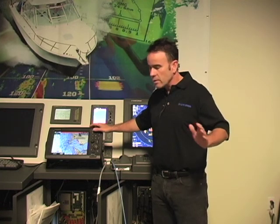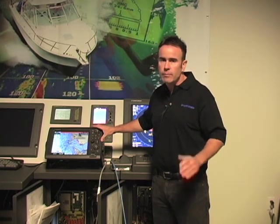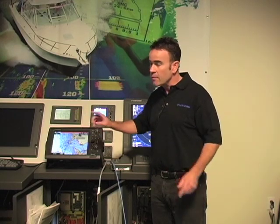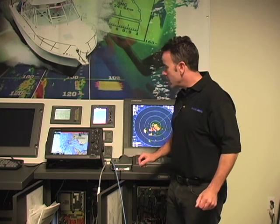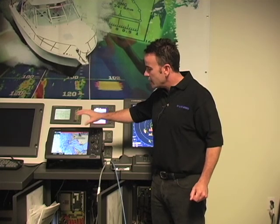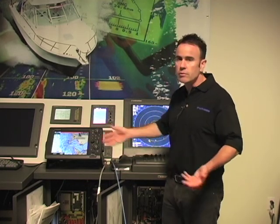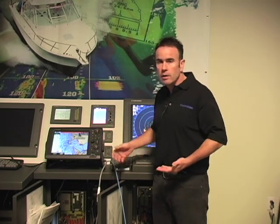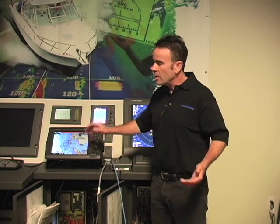The other consideration you need to look at closely is the heading and position sources. You'll want to make sure that the heading and position sources for both the X7 series radar and the NavNet 3D unit are the same — if you had different headings or positions, there's going to be problems. For this discussion, we are providing separate heading and position to each unit independently, so if one were to fail, you'd still have sensor inputs to the other. There are also ways to connect sensors to just one unit and have them feed that information over the network.